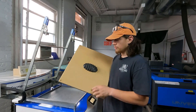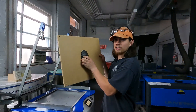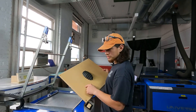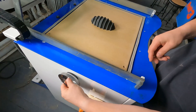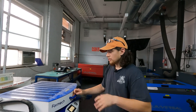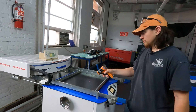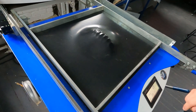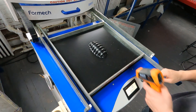We've got our solid base here. I've got a mold that has been mounted to this board with a few screws, so this is not going to come off. The benefit of this is every single one of my vacuum forms is going to be exactly the same. I'm going to mount this to the board with the table up. I've loaded the solid base, my mold is mounted to it, and it's heating up. We're going to slide that back and check our temperature — we are at 156 degrees Celsius. That's perfect.